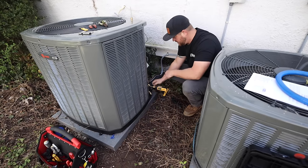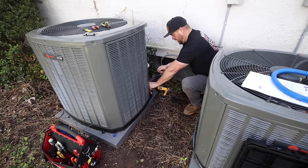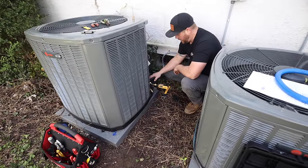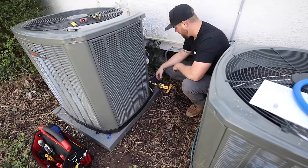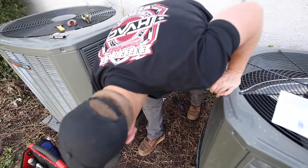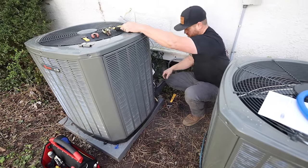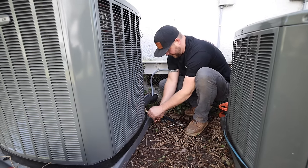You can do it one of two ways — open the high side or low side first. Really you could do it in either direction, but I think it's probably ideal to do the liquid line side first so that way it doesn't pull any oil out of the compressor. Once you've got the valve open, you can remove your gauge. Now that I've got my valves open, I'm going to go ahead and put my core back in.